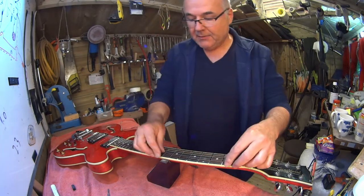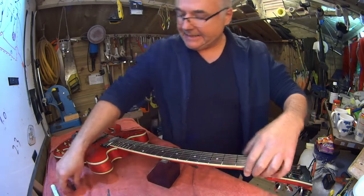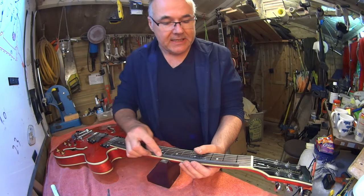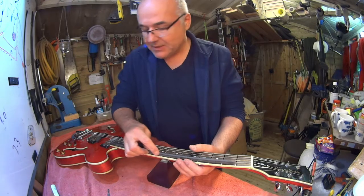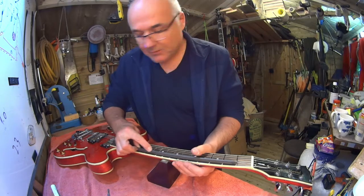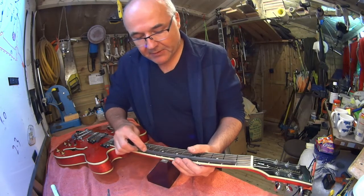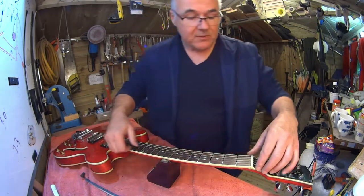That's dead on. Now, confident that I've recalibrated and that's correct, I'm going to go back at it and trust my calibration this time, handling it carefully so I don't accidentally undo the settings or anything, and then just let it work. And it is saying, okay, those are low frets compared to some of them, and that's okay with me. I'll just keep working for a little bit, trusting my calibration, go right to the edge. So I'm working on what I would call the E track, and freeing up the notes in that track where the E note sits.